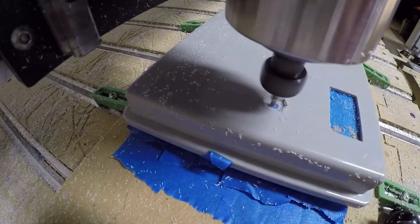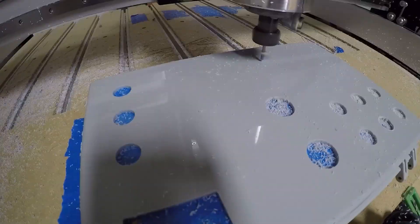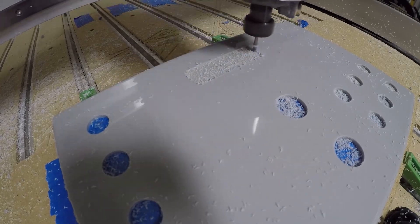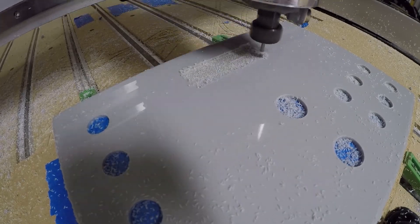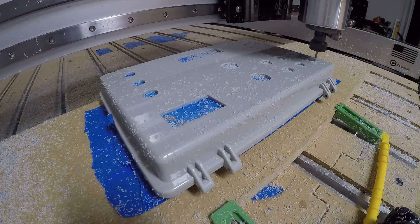We wanted to add manual control for all the features on board and place an LCD screen to read out all of the sensor information. I took the enclosure front panel off and fixtured it to the CNC table — running the program I was able to get all the switches in a nice organized pattern. Doing this on the CNC helps because in CAD software I was able to play around with various button layouts.